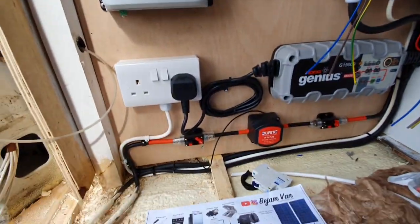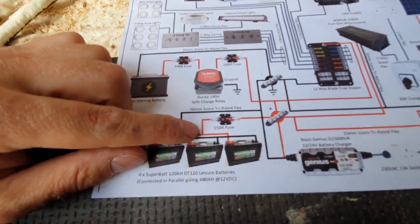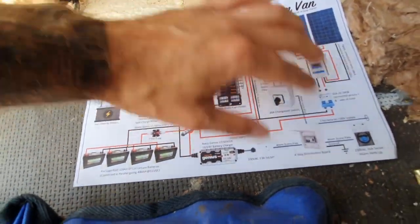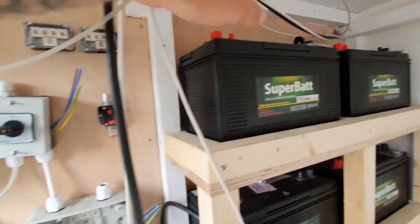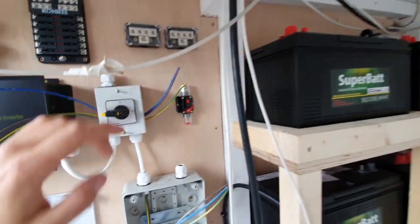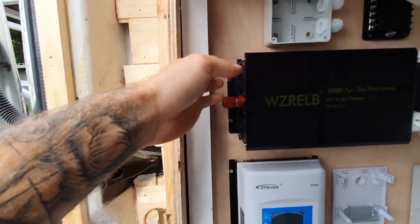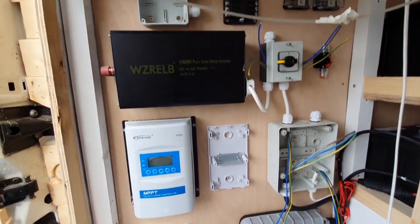This 150 amp fuse is there to protect the batteries from any overcurrent — it protects the system and the batteries from any faults. If anything happens, it takes out the fuse. I'll tap off the batteries up here and then loop down through the fuse and into the negative and positive blocks. There'll be no fuse on the negative — it'll just go straight in. And the inverter will wire from here over into these blocks.